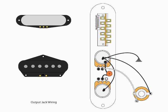Next, we do the output. Take one wire from lug number two — the center wire of your volume pot — and bring that down to the tip of the jack. Then take a ground wire and go to the ring portion of the jack, and your output jack is all wired up. From there we start wiring the pots: take lug number one of the volume and wire that to lug number three of the tone pot, shown here in green. You can use whatever color you want.